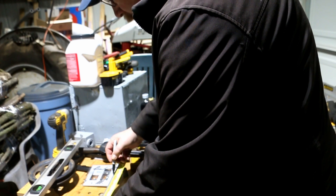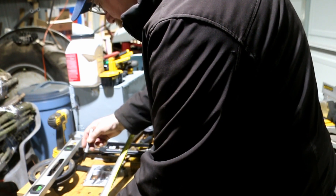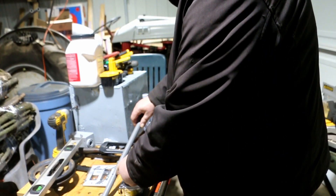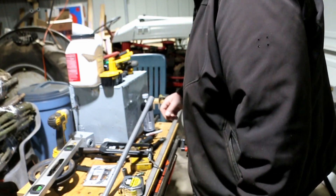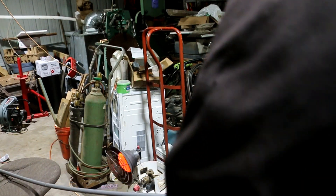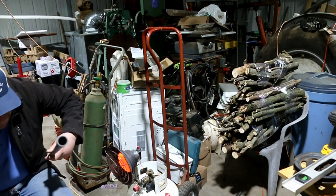15 and a half — that's to the outside of the bend. So I'm actually going to start my bend up about 12, and it's going to go about 19 and a half or so. I'm going to bring this down here and see if I can get this to sweep and have this end up 15 and a half inches from that end. I can trim a little bit if I need to, but I'm better off just heating it up and re-bending it, because this is a little easier to work with than EMT or rigid — it lets you go back and change your mind.